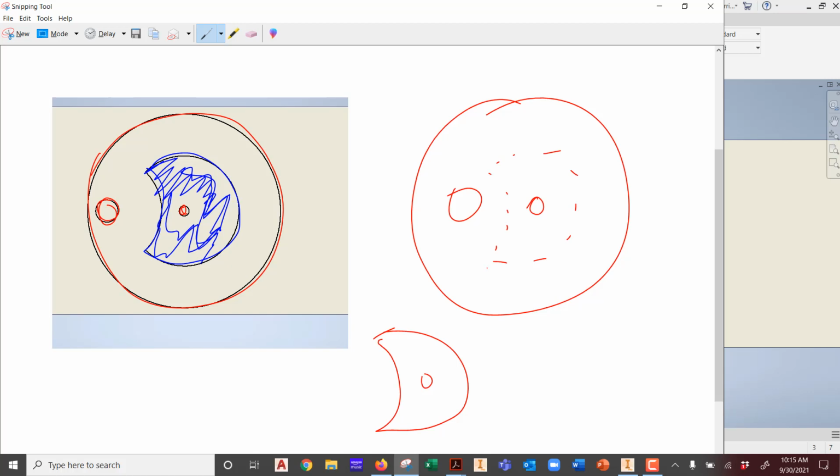The two ways we can get that location dead on, as far as the center, is obviously there's a center hole, right? But can I, in theory, put it off a little bit by accident? Is it possible that if I didn't have that etch, the pattern to use as a reference, I might position it incorrectly? I know I'm doing those very badly, sorry, because I can't actually rotate this thing. But even though it might share the same center, it is conceivably possible that I won't put it in just perfect. The only way I can do that is if I have a guide, right? The center hole is not a good enough guide. I do need an etching on this surface so I know where to glue that piece to, correct?